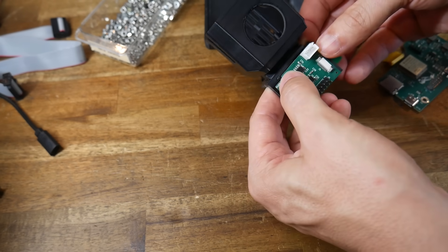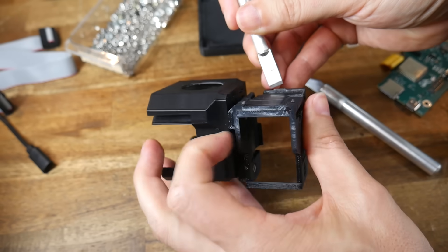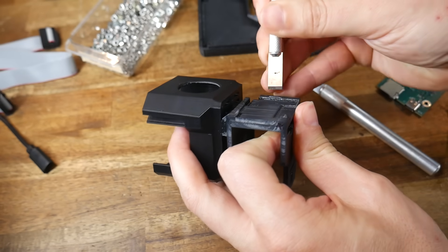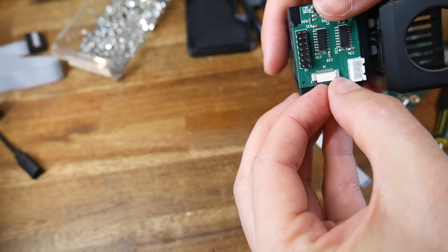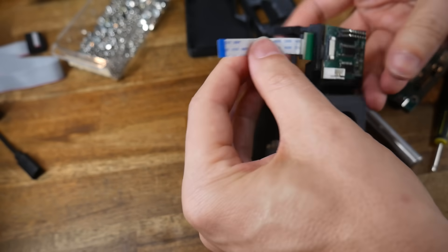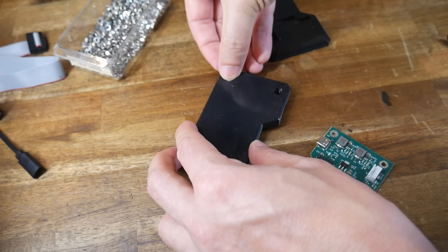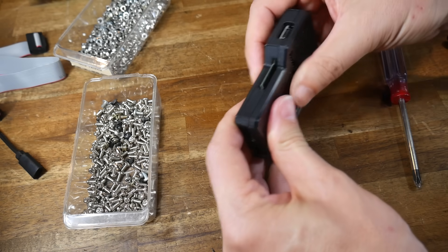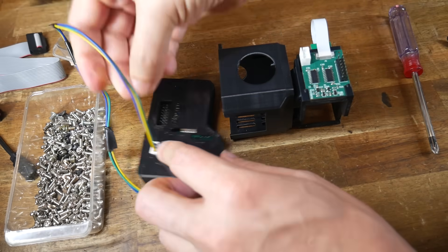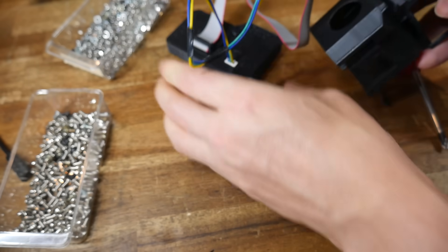The tip of the ink cartridge should sit around 2mm off the bed when the nozzle is all the way down and touching the bed. Once you have this height correct, you can remove the ink cartridge and tighten the two mounting bolts. Next, we take the interface board — there are some very delicate pins that must be protected as we install it. It goes on the inside of the cartridge holder and snaps into place without any fasteners. The daughter board has a matching cavity on the outside of this printed part — we slot it in sideways and then push down to snap it into its final position. We then connect a little ribbon cable between the two boards by pulling back the retainer on each port, pushing in the cable, and locking the retainer back down.